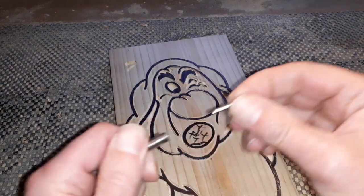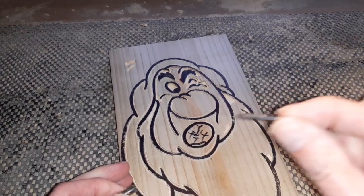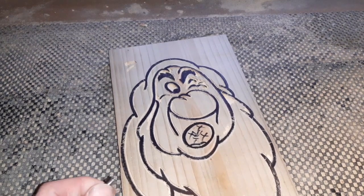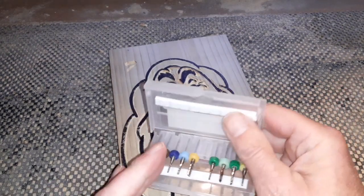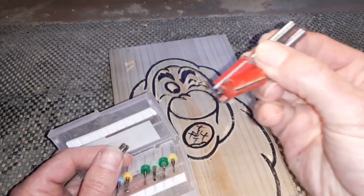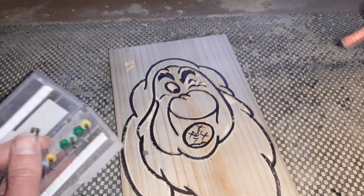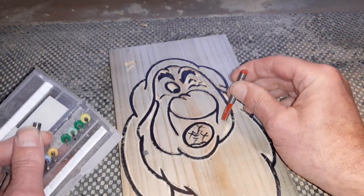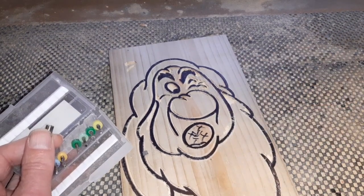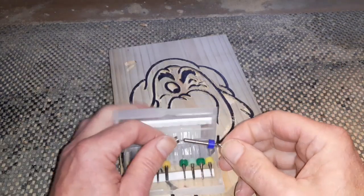You'll get a lot more projects out of that. Remember, these are just the bits I use. I use CNC bits. Other people like to use profile bits and liner bits. I like to use these end milling bits. Other folk use spiral up cuts or whatever. And I also like to use these straight flush bits. They're far too big for this one. You come in with something too big like that, as you're going round, you'll catch these thinner sections, and that will break that off no problem whatsoever. So to be safe and sound, we just use these little end milling bits.